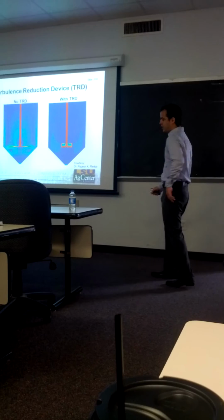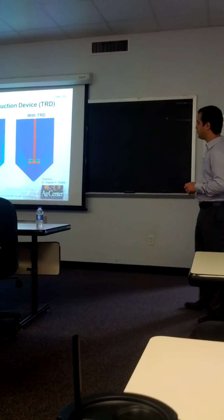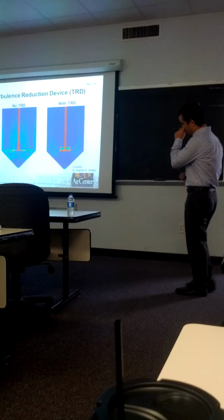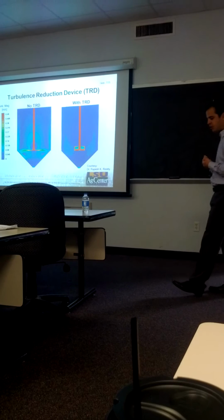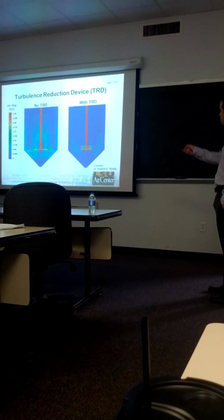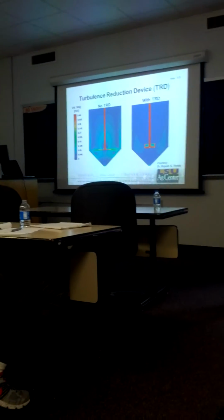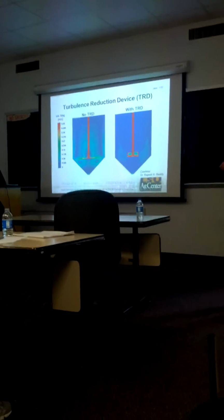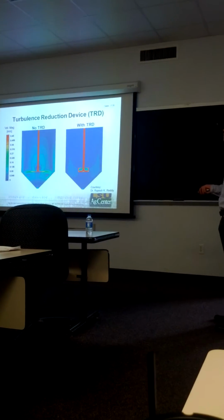Fortunately, in the Audubon Sugar Institute, which belongs to LSU Ag Center, Dr. Vadim Kochergin and Mr. Seigel developed a juice distributor that can enhance the clarification performance. They have proposed a turbulence reduction device, a juice distributor that dissipates momentum and effectively reduces the turbulent eddies present in the flow.